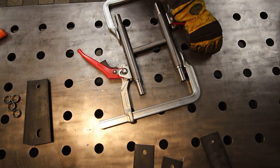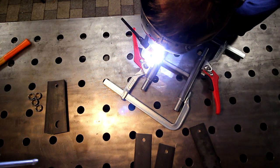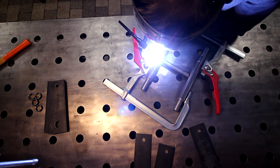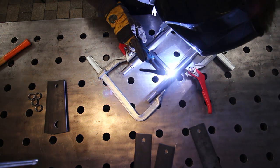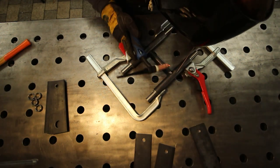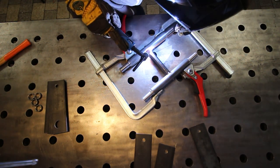To make these joints as strong as possible I not only welded the middle axis in place, I also stuck it through the outer ones. That has several advantages — for example I have more welding surface and it prevents distortion.